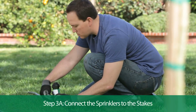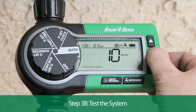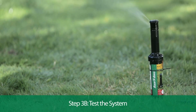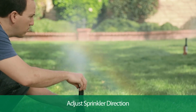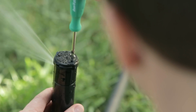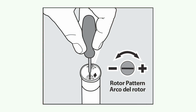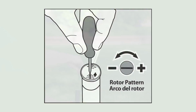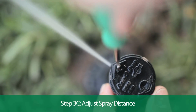To test the watering coverage, temporarily cable tie the sprinkler heads to the plastic stakes. Next, press the Water Now button on the timer and observe the sprinkler throw distance and pattern. Turn the center cap to the left to match the fixed left edge of your watering area. Next, use the rotor adjustment tool to adjust the pattern from 40 to 360 degrees. You can also use the rotor adjustment tool to adjust the spray distance.